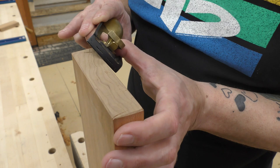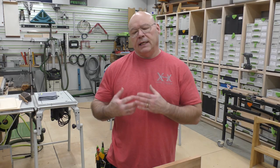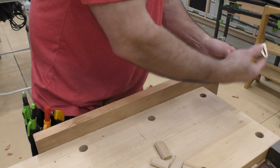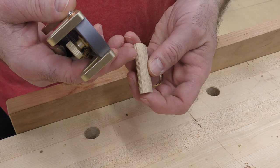I've always had an apron plane and I've tried a variety of different ones. When I say an apron plane, it fits right in my pouch — it's always on me. This is really nice; it's all aluminum but has an adjustable throat. I'm building something and I can do quick knockoffs just like this. In a previous video we were showing how to use the Domino and different tenons, and when you're dry fitting, the mortises can get really tight. So I use this to knock the edge off quickly — I use it all the time when working with the Domino joiner.